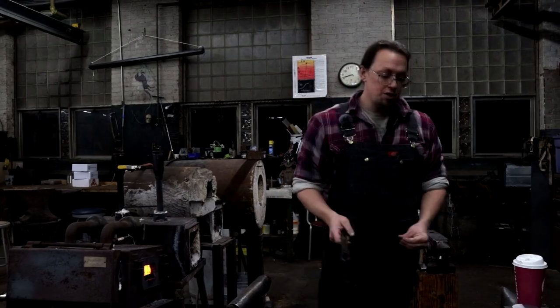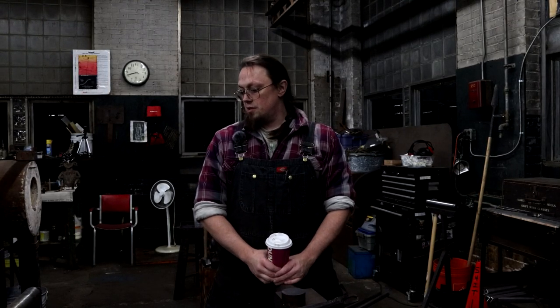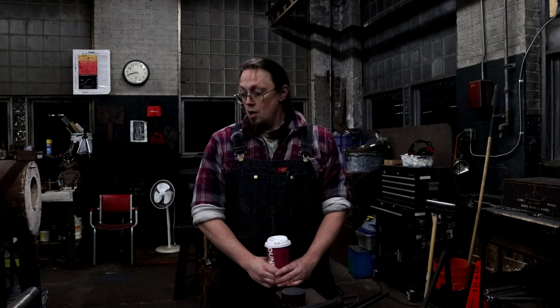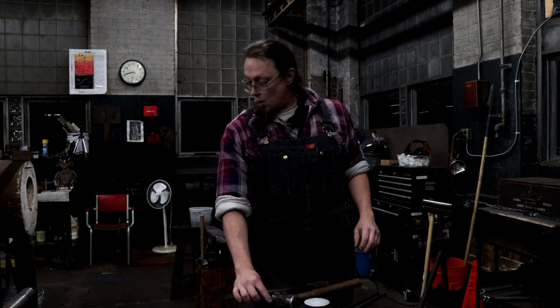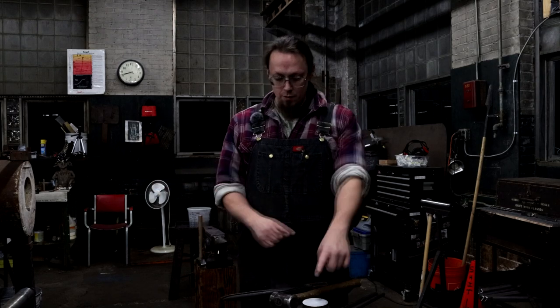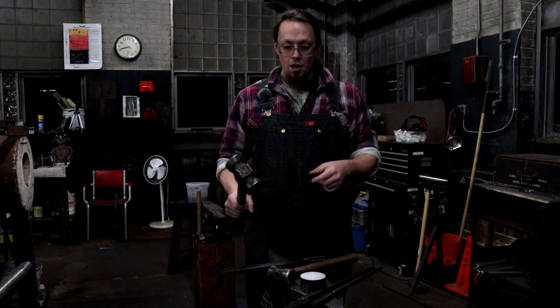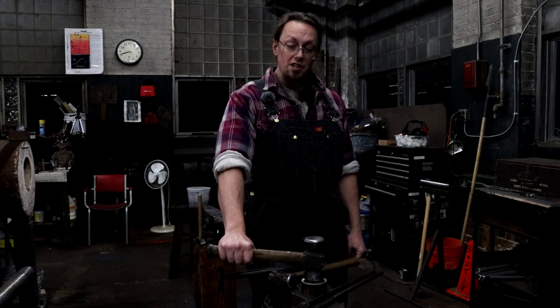I need a bunch of tools in order to get all the stuff I need to get done at speed. The dishing stake is just because I'm about to get into a lot of sheet metal forming for the scabbard and we don't have a dishing shape. I'm hoping the dishing stake may take one heat and one heat only. The simplest action possible: I'm taking one of these round blanks, getting it yellow hot, running over, putting it in the hydro press, putting this hammer on top, and hydro pressing it in. That'll give me a dishing stake in one shot.